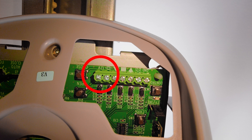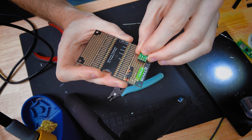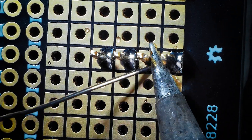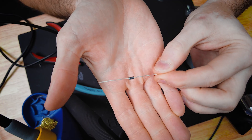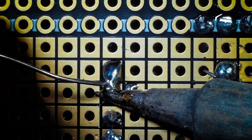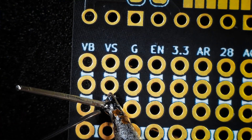The remaining two terminals are for the power connection. My garage door motor also provides 12 volt DC power, and I'll use a switch mode DC-to-DC converter to reduce that to 5 volts, which is compatible with the Pico W. The converter is soldered into place with the input and shutdown pins connected together to ensure stable operation. A Schottky diode goes from the output to the VSYS pin on the Pico — this is the preferred way to inject external power. The diode means we can still connect to the Pico via USB even while it's receiving external power.